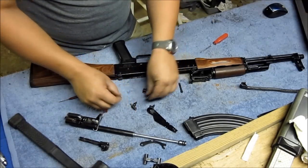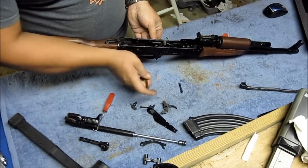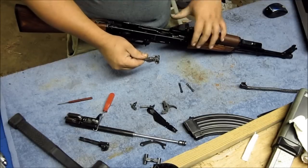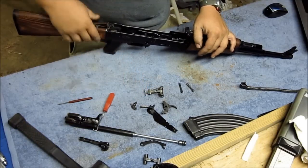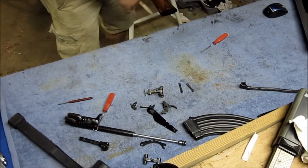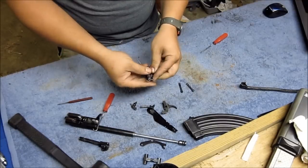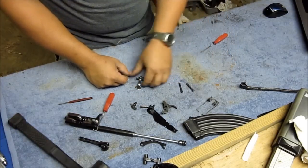It's easily put back together, so we'll just leave that separate. Now take your hammer pin out — you might have to knock this one out. Mine pushed right out. Be careful when you take this hammer out where you've got it crisscrossed — go ahead and grab a hold of it really tight, twist and pull out. Make sure you keep a hold and make sure those things are still crisscrossed and gently lay it down. Now go ahead and take your hammer — carefully un-crisscross the spring, bring each arm around, wiggle your hammer out, and there's your hammer.